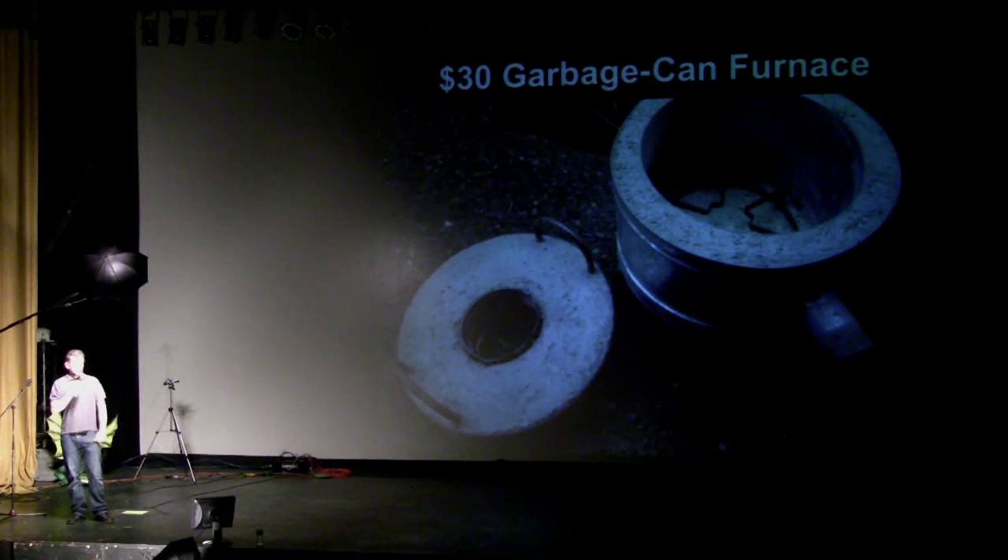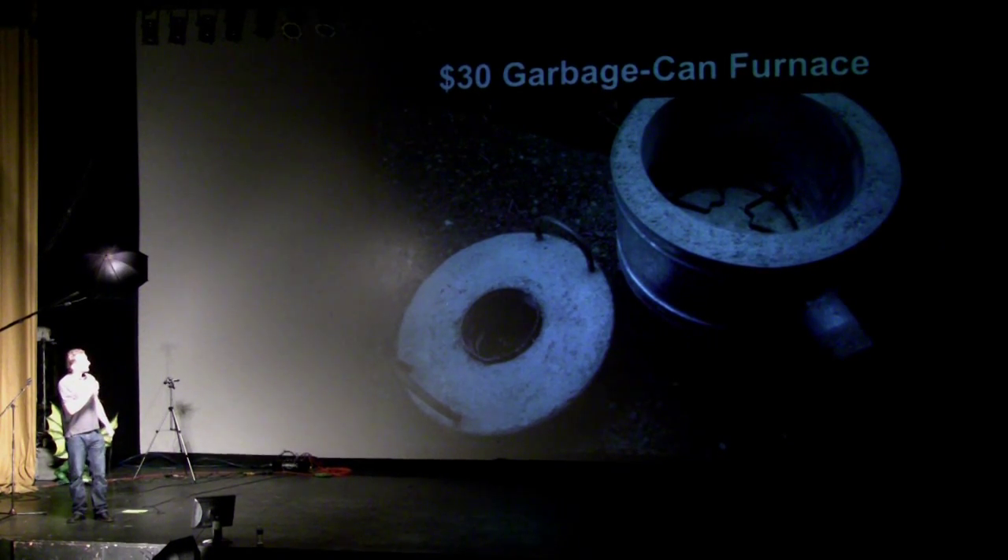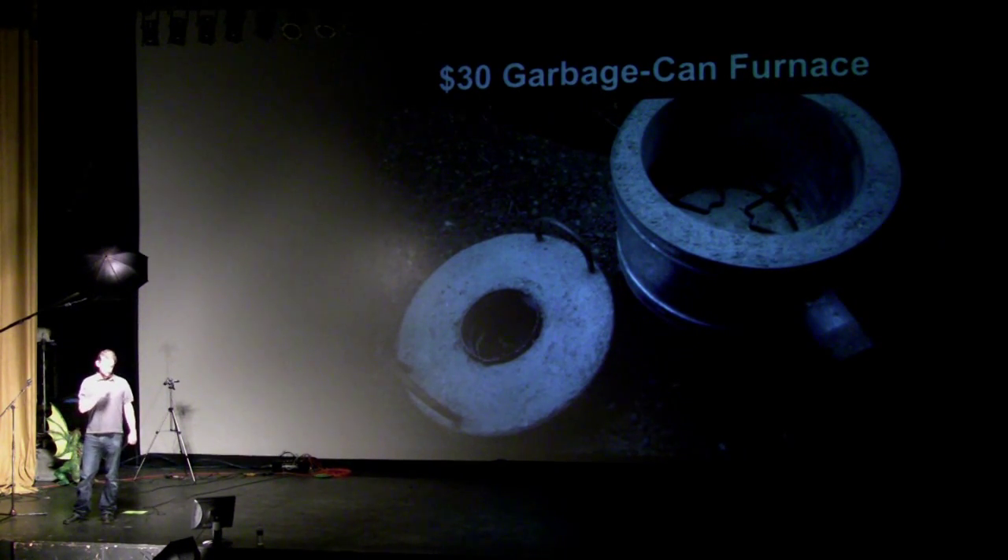There's some parts, some scraps — bits and pieces you can put together yourself from the thrift store and the hardware store. Garbage can furnace: that's a garbage can inside a garbage can, or a metal pipe inside a metal pipe. The key to making your furnace insulated is that layer in between those two layers of metal, and that is cement mixed with perlite. Perlite you can get at Home Depot-type stores or nurseries — it's a porous, pumice-like stone, and it insulates really well.